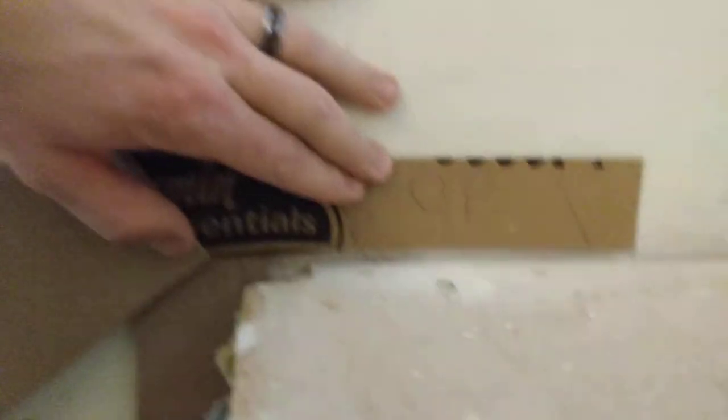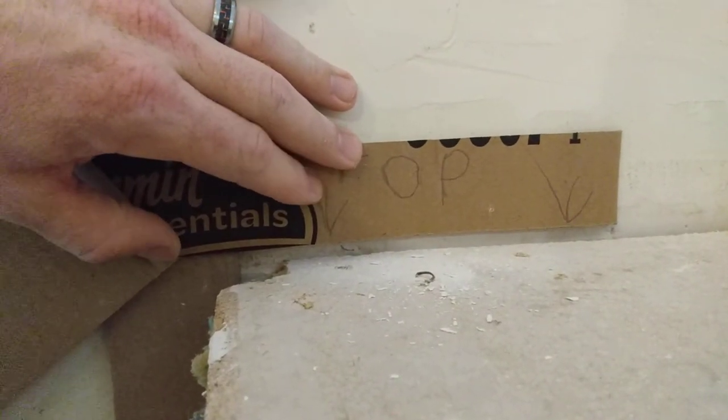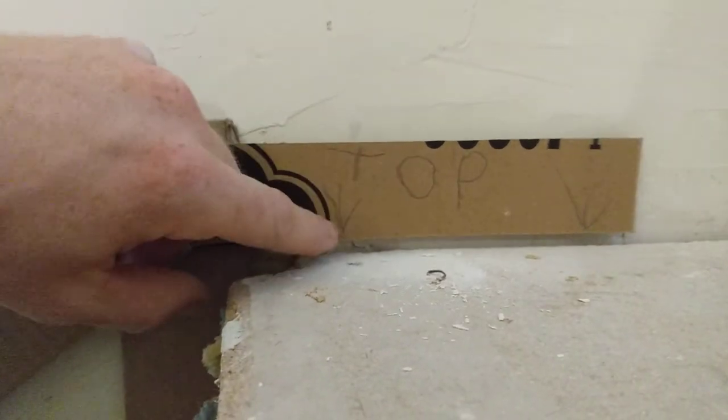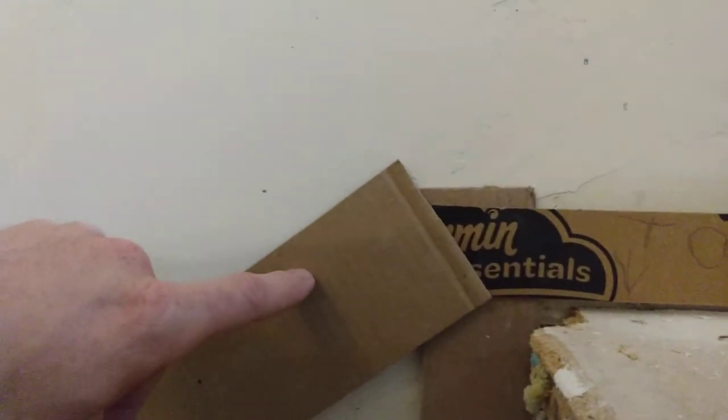On this side I hovered it a half inch because I hovered my baseboards a half inch. If I don't do that, there will be a half inch gap between the top of my stair skirt right here and where my baseboard comes out and sits over the top. So that's where the top of the stair skirt will be on this side so my baseboards can sit on it.